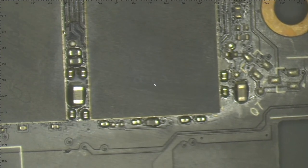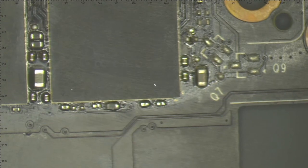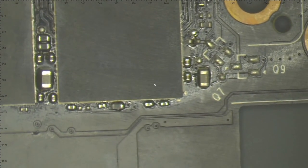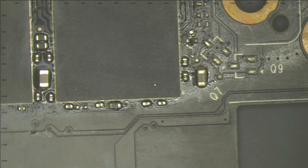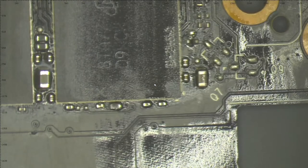So here are the RAM chips closer to the PCI slot. Right here is the PCI slot. And as you know from my previous videos, these 2080 Ti's have a big problem with these chips closer to the PCI slot. Also, the production code of these chips is old. So we have to replace them all, maybe.